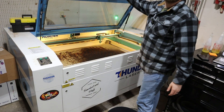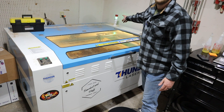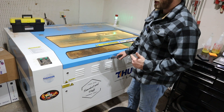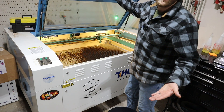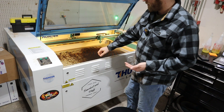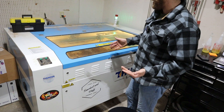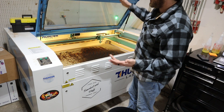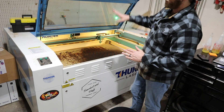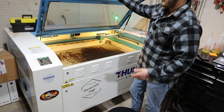One of the things that was really hard for me for about the first six months was the safety mechanism. This light in the back is red/green — green means it's off, red means the laser is on. You couldn't have the laser running while the door was open; there's a sensor. You can view that as a plus, but I viewed it as a minus because I always wanted the door open for filming or just accessing things. But I then realized there's a setting in LightBurn where you can disable that. Ever since then, this big door has been such a huge perk — you get all the room to line up material, and if you want to film things, it's really easy to get good footage in here.